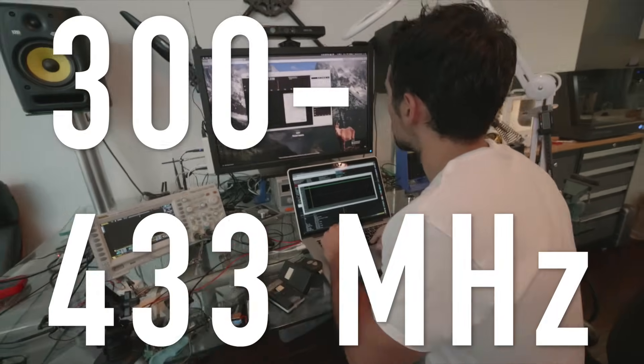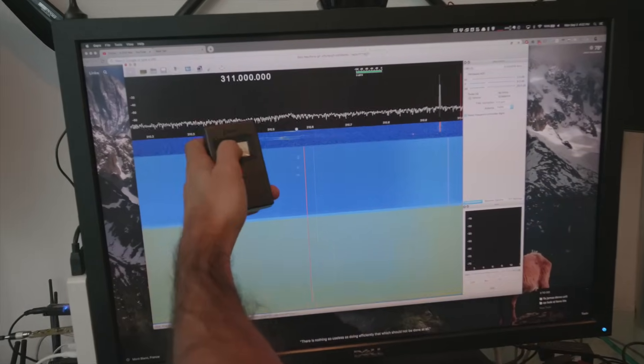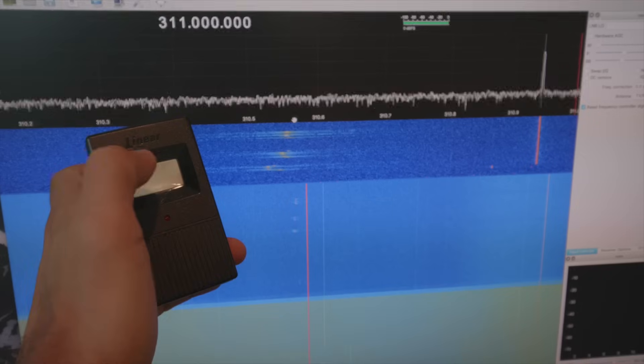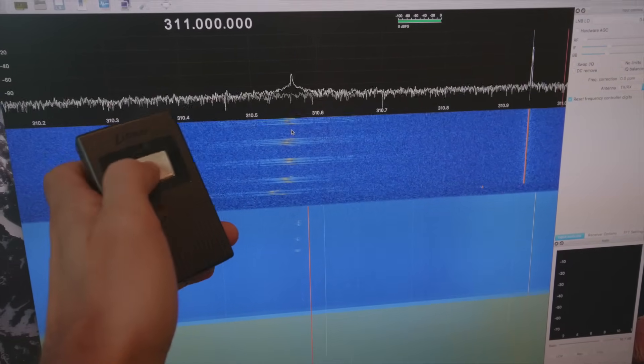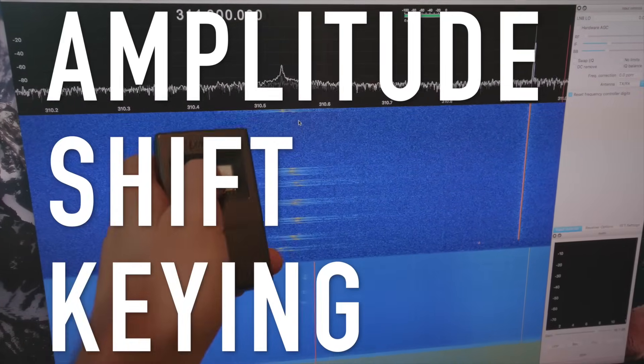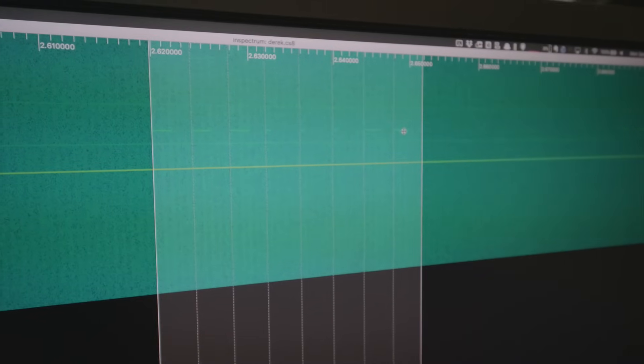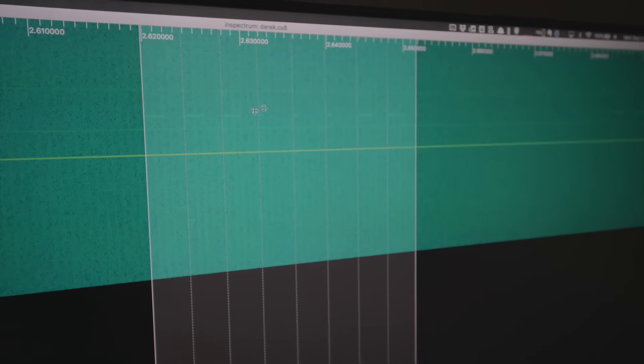Typically it's going to be like 300 or 433 megahertz. What I can tell just by looking at this is how it's actually modulating the signal and how it's sending it. This is called amplitude shift keying, ASK. What's happening is every time I'm holding down the button, multiple bits are getting sent on a single frequency. It has to do with the time that it's on or off, which means a one or a zero. Let me ask the obvious question — how secure is my garage? It's not. Why don't we actually record the data? So it looks like your garage uses an 8-bit code.